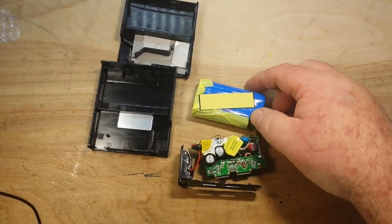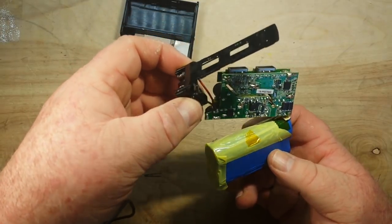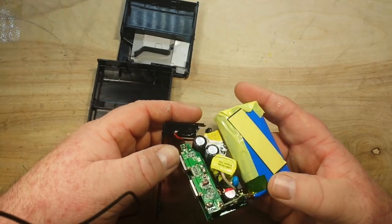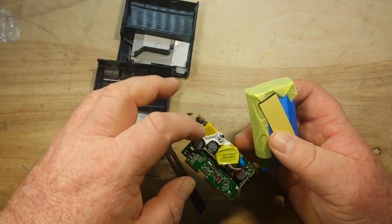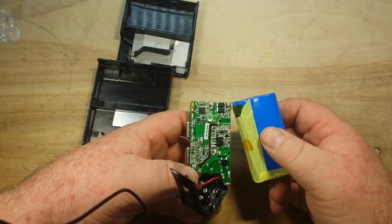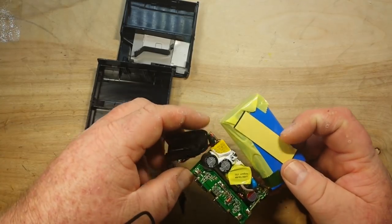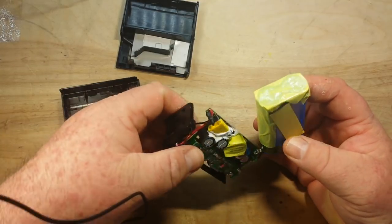We are in. What you can see here are two 18650 cells. Here is the US plug adapter — and like I said, it will be very easy for them to swap this out and change it for whatever region you're from. We see the two USB ports and the power switch. We have our rectification circuitry here, a nice class Y transfer capacitor, inductor, and a couple of big smoothing caps. Turning it over, there's about two millimeter spacing — very nice anti-tracking slots. This is quite well put together, there's a lot of circuitry here. There's a thermistor for heat monitoring, and the case is very nicely done — high quality all around.